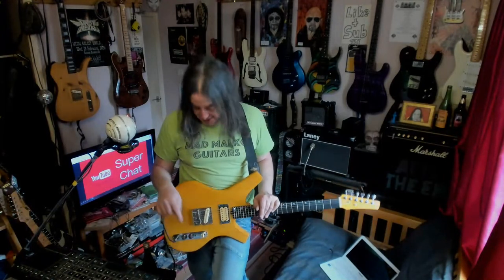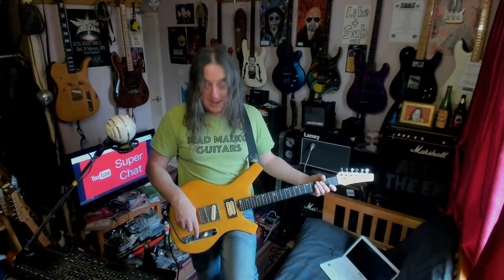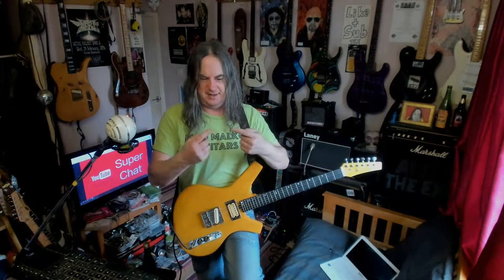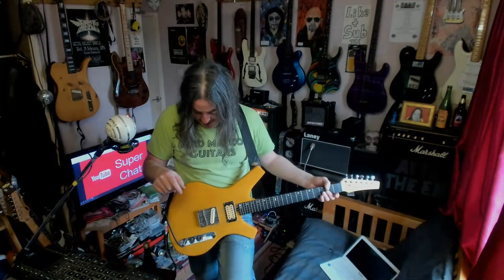Yeah, but I was thinking about it because I'm sitting here running a single coil and a humbucker. And to be honest, I don't even know what pots are in this. It was the pots that came with, I think it must be from an Ibanez RG. Big pots, there's only like one wire in here. The lugs just touch each other, so I just soldered them together. And no earths or anything like that, because you don't need it, because it's in a metal plate.